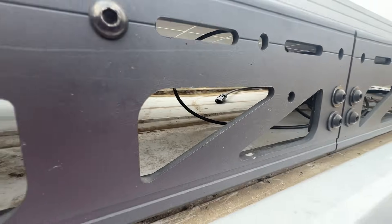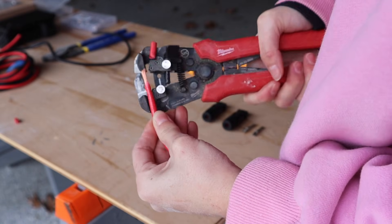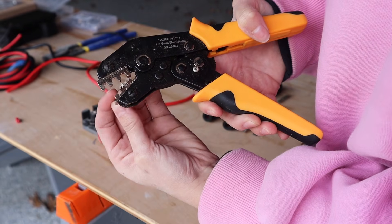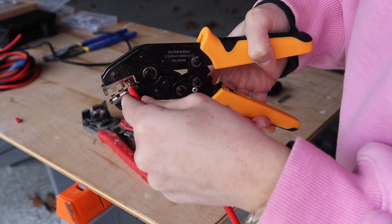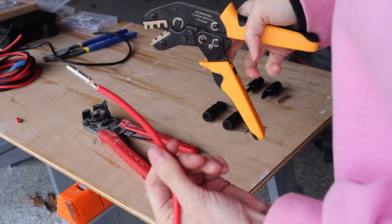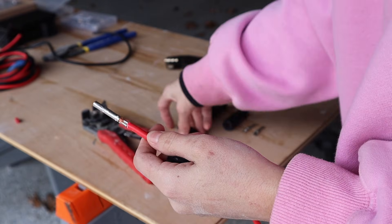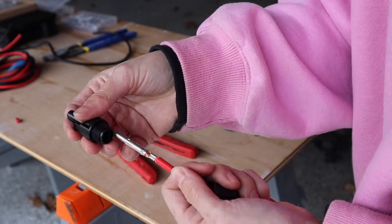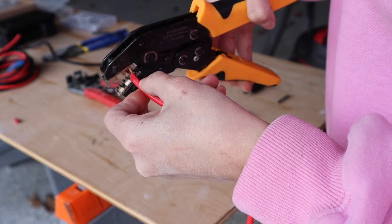To solve this I needed to add some slack to one of my panels. To make an MC4 extension cable I cut two feet of 10-gauge wire, added a male MC4 on one end and a female MC4 on the other end of the positive and negative wires. You need an MC4 crimp tool to do this. For reference, the female copper socket clicks into the male plastic housing piece, and the smaller male pin clicks into the female plastic housing.